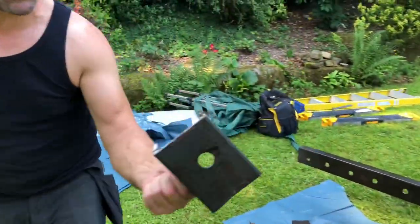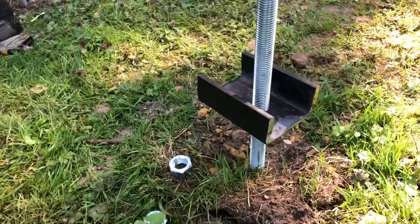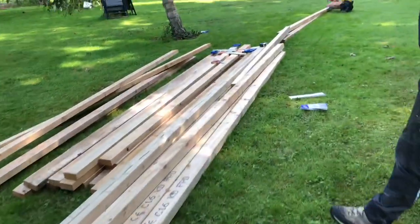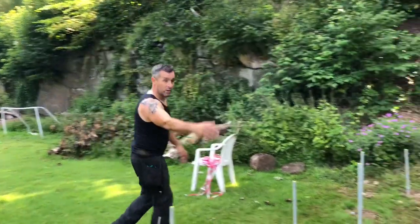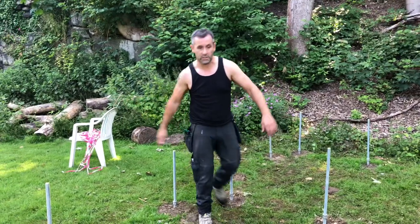That's what we're left with — the shoe — that will then sit on there like that. We then get this four-by-two which has been pressure treated, and Emmy over there is joining them together because they're not long enough. What we'll do is drop one straight down that row, one down that row, one down that row, and then we'll create the box with two on the perimeter as well.